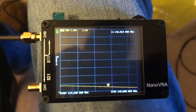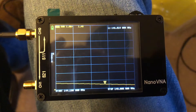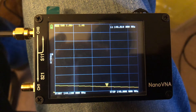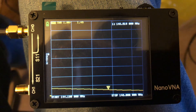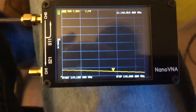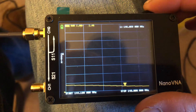I wanted to hook it up to the NanoVNA. I'm looking good on 2 meters here — I just tested the 440 side and that was good as well. That's around the center of the calling frequency, about a 1.48 SWR. I'm kind of moving over here so that's why it's moving around a little bit, but it works pretty good.